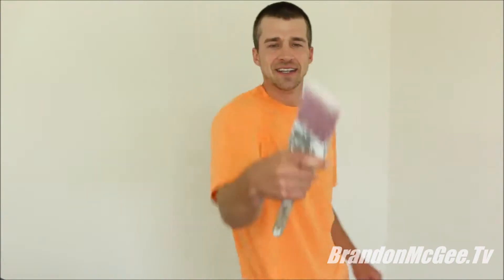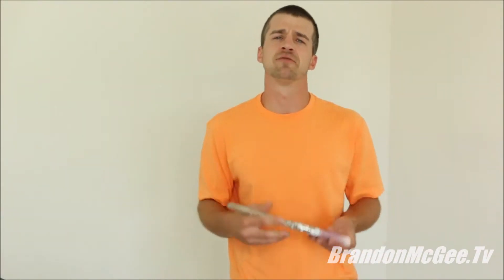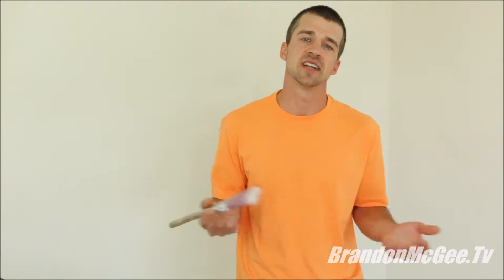There are a couple of things you're going to need before you start painting. Of course you're going to need a paintbrush. This one is a three inch paintbrush for walls. I find a three inch will help you move faster instead of the two and a half inch or inch and a half brush, which just can't transfer as much paint.